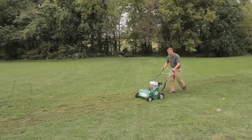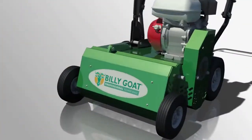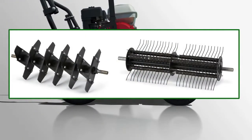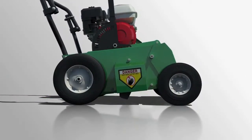The PR-550 comes standard with Honda or Briggs power, coupled to a free-swing, heat-treated, tempered flail blade reel, mounted to cast-iron pillow block bearings that are greasable. Optional spring or verti-slicing delta reels are available. In addition, the unit features infinite height adjustment for precise depth adjustment and gives longer blade life than presets.